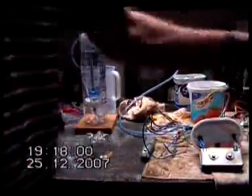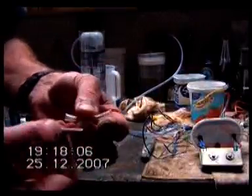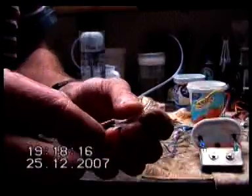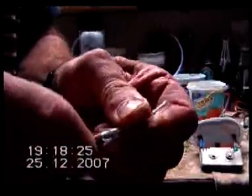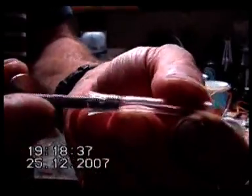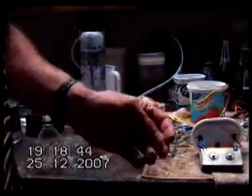What I've done is I've got my fish tank air hose and cut that a little bit longer than my bolts I'm putting through my plates. I've split the end in four ways and spread it out. I've got my bolt with my large washer on it, and all you do is just screw that in. This is about a 3mm opening in my hose and there are 4mm bolts, so that's a really tight fit — you don't need them that tight, but that's just what I had on hand. So you just keep screwing that in, sometimes you've got to clamp it in the vise between two bits of wood. That insulates the whole bolt — these spread out the end up against the washer, and you split the other end to do the same.